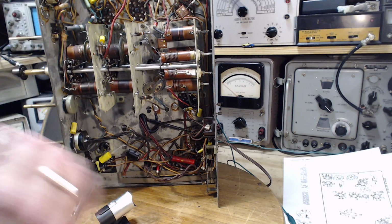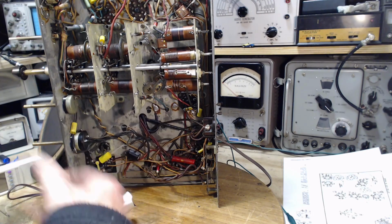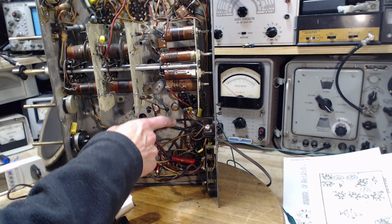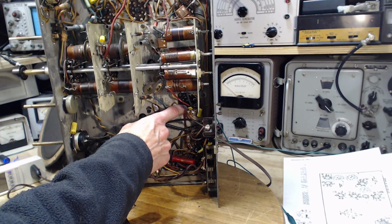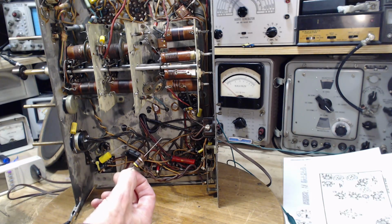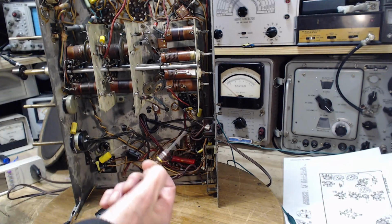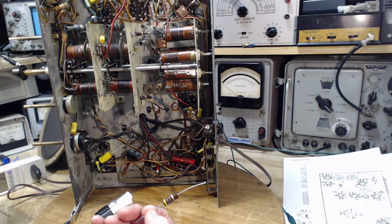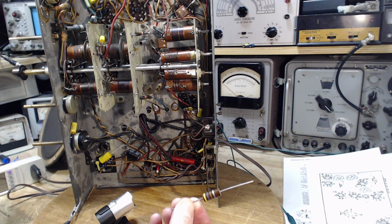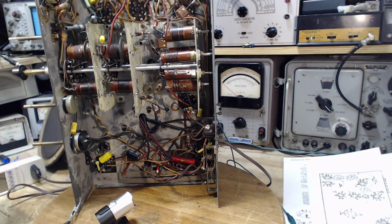So in a problem like this, where the oscillator won't oscillate, everything I do makes me a little bit nervous, because I could accidentally introduce another reason for the oscillator to not oscillate. So for instance, this resistor, the 470 here, if I'd replace this with one of these guys, saying to myself, well, there's no reason for it to be that precise anyway, about 470, 520, what could the difference be? And I put this in, and it turns out that this in fact is a critical element, that 470 really is exactly the resistor value that needs to be in there, which I kind of doubt. But if that were the case, I could introduce a new cause for non-oscillation. Now I've got two problems in there, one of which I made. And good luck to me on finding that down the road. That's really a real challenging thing to sort out.